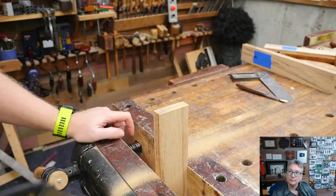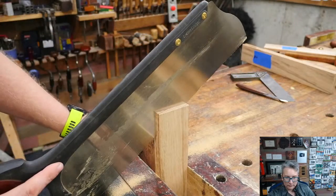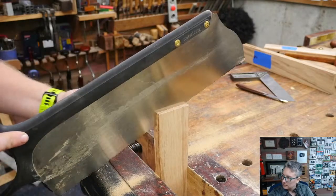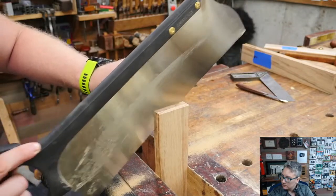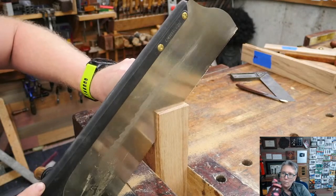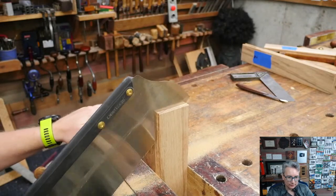Okay, here I'm actually cutting off the line this way a little bit too much. And one of the things that people want to do is once they get down to that point, they want to start steering and forcing the saw to get back off that line. What you actually want to do is back up to about here, away from it, twist the saw so I'm pushing against the way I want to go, and correct the cut. Use the side of the teeth to push it over a little bit more. Correct your cut up above, so that when you get back down here, you're where you want to be, rather than trying to steer it out. That'll give you a cleaner fit.